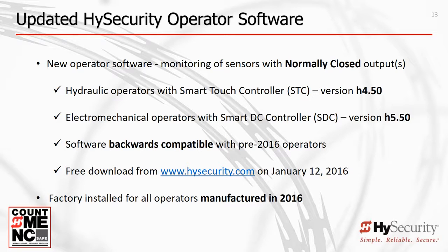Two control boards are employed in HySecurity's entire line of hydraulic and electromechanical gate operators for crash, industrial, commercial, and parking applications. That's only 2 control boards for 5 operator product lines and more than 50 operator models. Hydraulically powered operators use the Smart Touch controller, and 24-volt DC electromechanical operators use the Smart DC controller. Each of these controllers runs its own software.